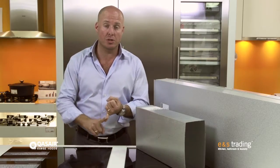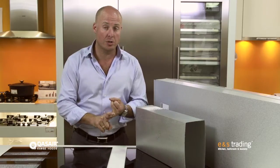What we find with Quasir is they manufacture single motor rangehoods, twin motor rangehoods, and three motor rangehoods. When you're up to three motors with a Quasir rangehood, you're nearly at three thousand cubic metres per hour of air movement. Some of the more basic rangehoods in the marketplace only move two or three hundred cubic metres per hour. So imagine a rangehood that's moving three thousand — that's a lot of air, and we need specific ducting to take that air away efficiently and effectively.